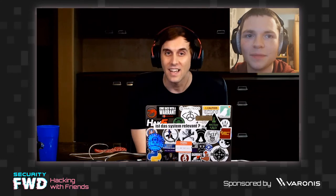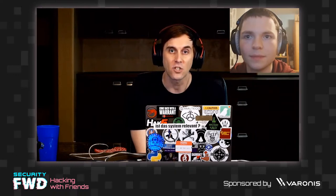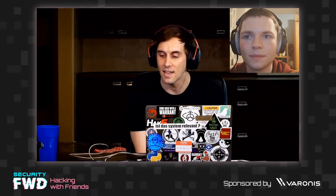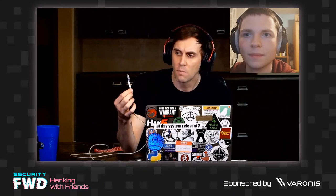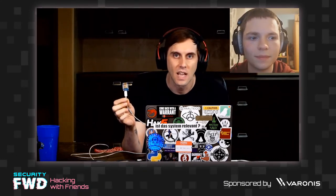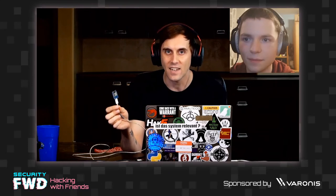But aside from that, it really means that if you have access to a computer with a USB port, then you can control this and make it run potentially much more powerful things by scripting things on the computer and then having it sent to the Deauther to have it execute it, which is really cool. Because at that point, we're treating this almost like a wireless network adapter that's pre-programmed to do certain things, rather than a microcontroller that we're starting with from scratch. At this point, it already has a framework to do all these great attacks built into it.